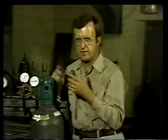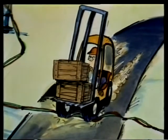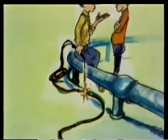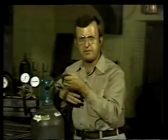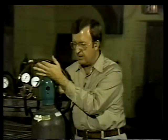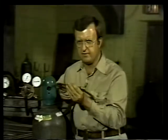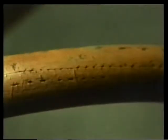The hoses are one of the most abused parts of a welding rig. Too often, inexperienced welders run hoses across traffic lanes and directly under places where other welders are working, fail to keep the hoses clear of equipment, and coil the hoses carelessly. These hoses carry flammable and explosive gases, and if they're damaged, the gases can escape — presenting a very serious safety hazard. It doesn't take much to cut the soft flexible material that these hoses are made of. So here are some basic rules: always inspect your hoses before starting any job — cuts, cracking, and other signs of weakness are all good reasons for getting a replacement hose.